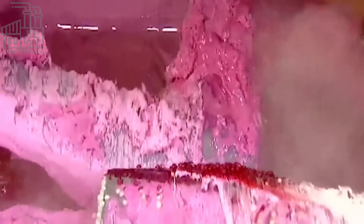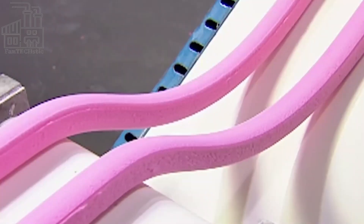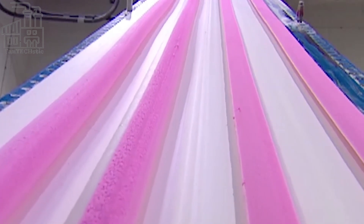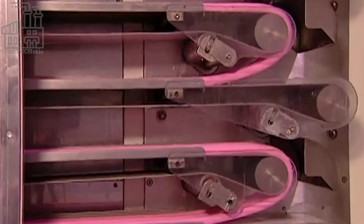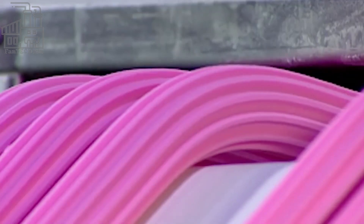Huge chunks of the gum are cut and put into a roller that squeezes out the gum into long strips, which are passed through an extrusion machine that cuts these strips into the width of an actual bubble gum. Next, the thin gum strips are passed through a machine that sprinkles granulated sugar on them for seasoning and, in preparation for the next phase, cutting. A steel conveyor then transports the gum strips to a slicing machine which divides the gum into small individual pieces.